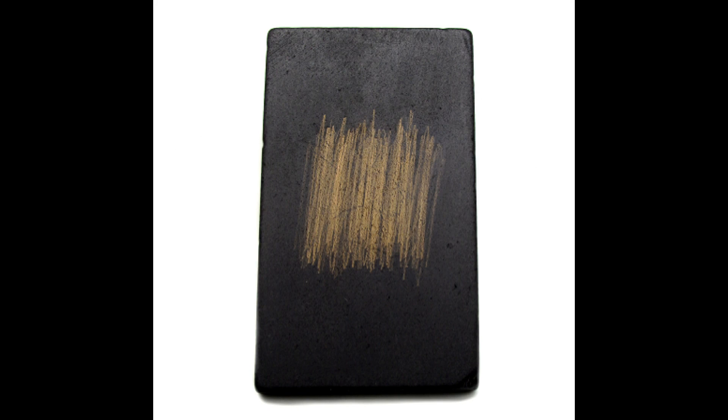The touchstone method involves the use of a dark colored stone such as slate or lydite. The touchstone must be thoroughly clean and free of any previous samples or leftover testing solutions. To clean it, place it face down on a piece of 320-grit sandpaper on a flat surface and sand off any sample material, then neutralize it in a bath of water and baking soda, rinsing it off and making sure it is dry before its next use.